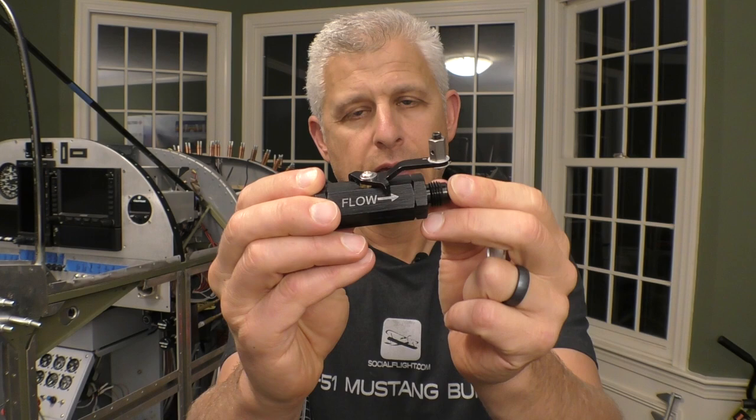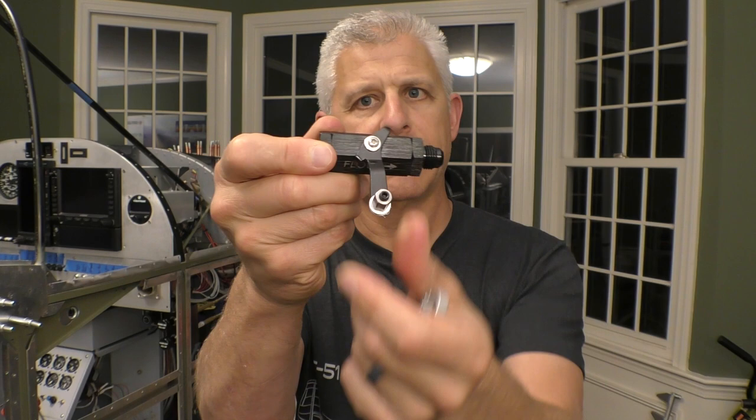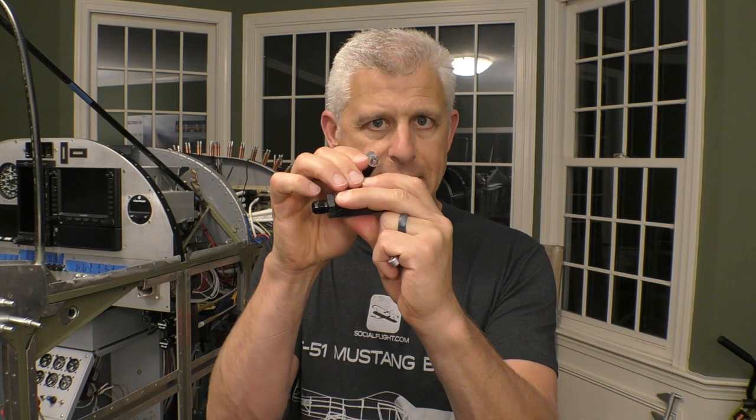This one is going back for the emergency gear dump, and this is the fuel shutoff, where I've mounted the control — it just rotates like that and goes forward. I'll put a little bracket in the back and get everything set up so the cable is controlled in place. You also want a little bit of cushion on the control in the front so you know you've hit the stop, and you do the same thing on the back — you don't want the arm to hit the sheath of the cable; you want the arm to hit its end of travel before that. We put cushion on both ends to make sure everything is done correctly.